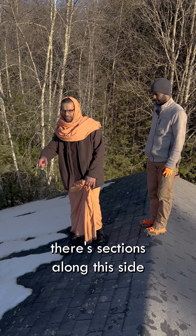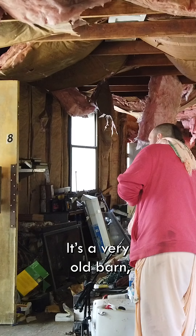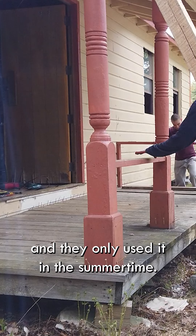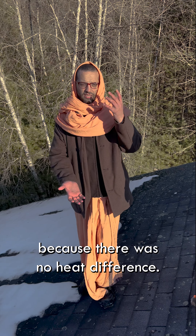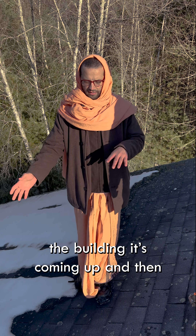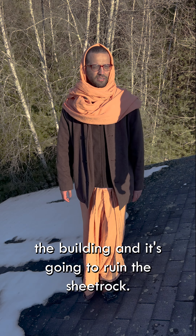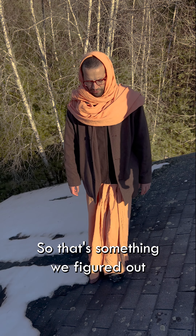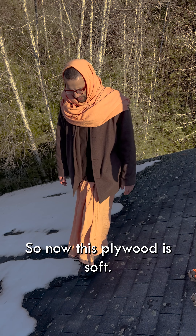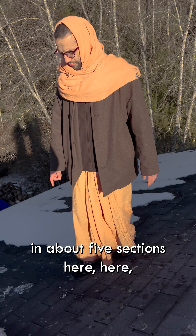There are sections along this side where the roofing is soft. It's a very old barn and the original owners never put tar paper — they only used it in summer time, so maybe it wasn't an issue. But with the heat being inside the building, the condensation without tar paper is all going into the building and it's going to ruin the sheetrock. We didn't know they didn't have the tar paper on it. Now this plywood is soft and we're going to have to replace it.